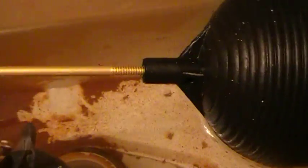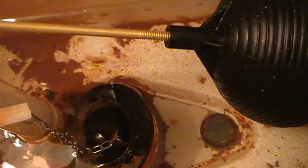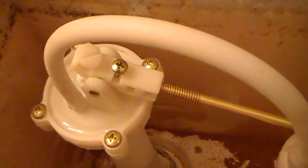The big thing is to make sure that the flapper doesn't get tied up with the float rod when the toilet is flushed. I'm just going to bring it up just a little turn to free the rod so the float rises away from the flapper.